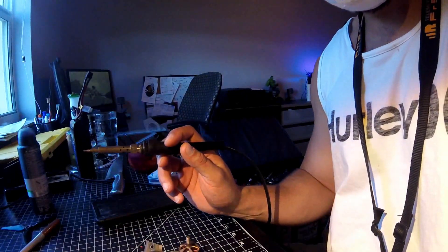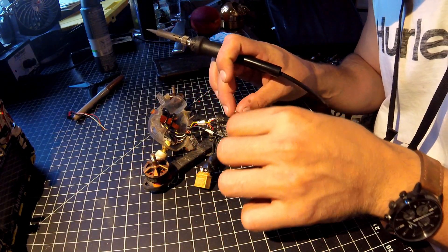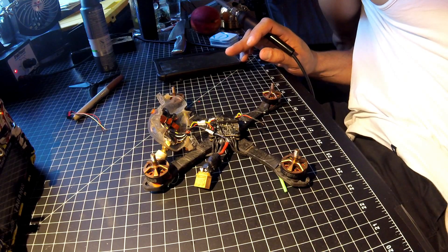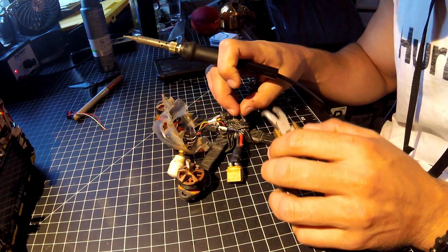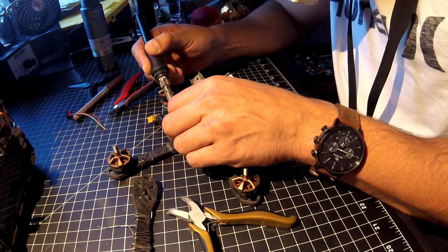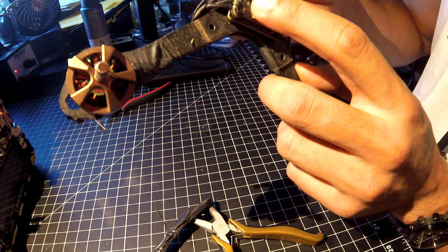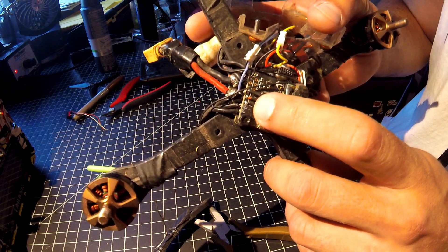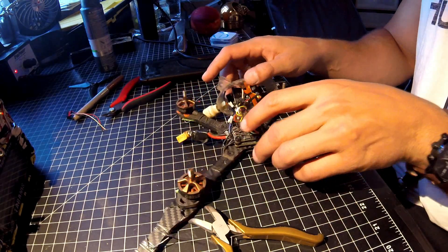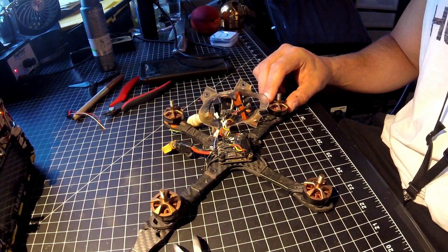Now that we've got the XM Plus updated with the firmware that's going to work with BetaFlight to basically send the RSSI data from the flight controller and receiver back to your remote - I've got my RSSI soldered back into the appropriate S-Bus. 5-volt and ground is there and it's good to go. I'm going to go ahead and finish up the steps needed to get BetaFlight to show the RSSI on my OSD.